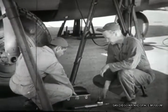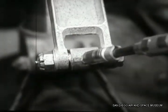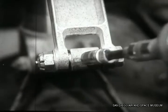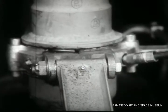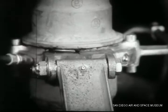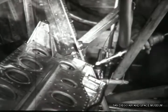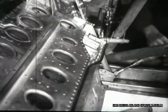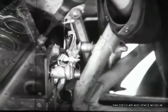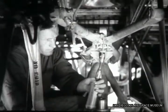Next, they get set to lubricate the landing and nose wheel gear. Chandler returns to the nose wheel well and approaches the scissors joint with his grease gun at ready, then fires a salvo at the grease fitting — making sure to get them all, including the drag link fitting, the fairing links of the nose wheel door, the gear box, and the nose wheel latch mechanism.